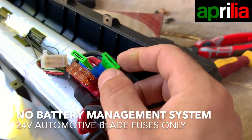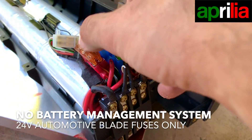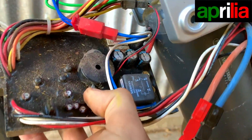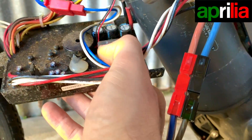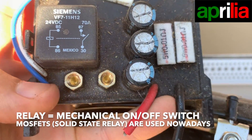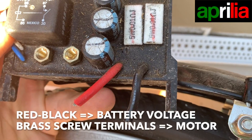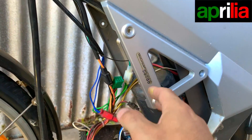It was pretty high-tech back in the day — well, not very high-tech, but for that time it was like wow, electric stuff. But it's just like blades, fused and all these things. The controller here was all potted — you see here, like a hard epoxy. It's all very dusty. Heatsink all in one piece. And there was a buzzer here, so maybe if there was any error it would signal something. A little relay here for the on and off. So this is a 24-volt relay made by Siemens — nice brand. When you turn it on and off, you actually activate or open the circuit and disengage the controller. So the red and black wires are actually the battery wires, and here is what goes to the motor. It's not very complicated wiring — pretty basic.